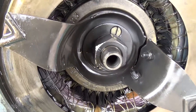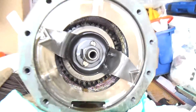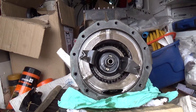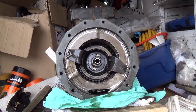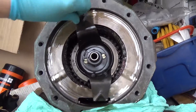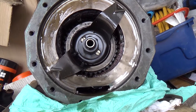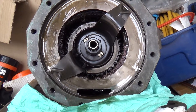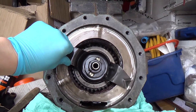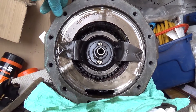That colouring is probably more dirt than overheating. Maybe it sat there and maybe that seized it up. It might have been cycling — it's got a thermistor, so maybe it's cycled on the thermistor a few times. That might have burnt it. It was with the faulty contactor as well. I could see this being stuck, damaging the contactor, but the contactor being bad — I can't see that making this shear off.